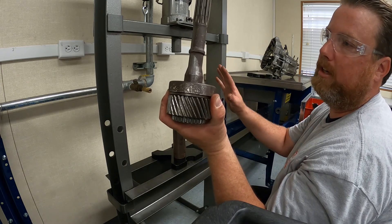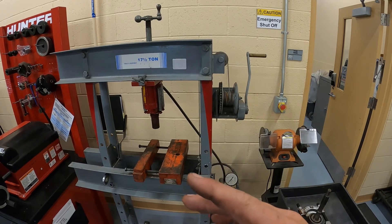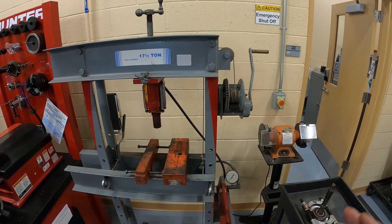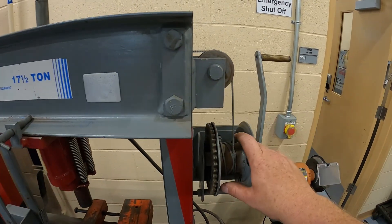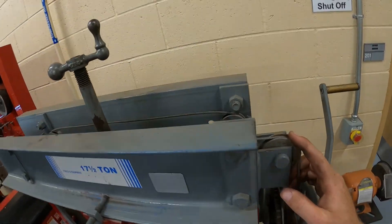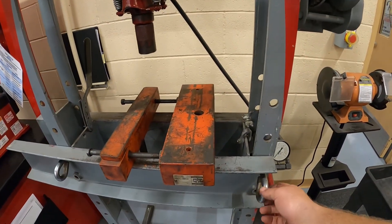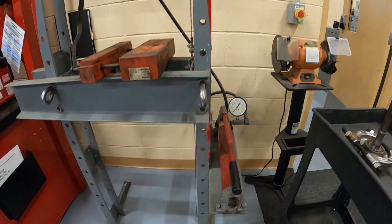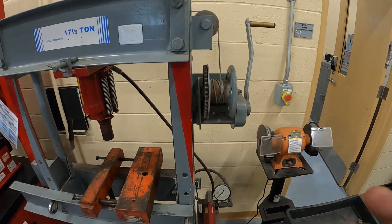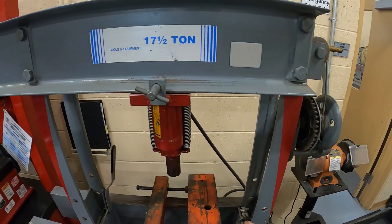Now I'll go over and show you a different hydraulic press. This press is a little bit more traditional to what you'd see in a regular shop. It has a couple key features that are different from the press we used before. One of the first things to note is that the deck goes up and down on a cable system - we have a reel with a cable that goes around the top and lifts the deck up nice and even. You take a little tension off the pins, then crank up or down to get the height. It's a little less strenuous and nicer in the sense that you're not straining your back at all.